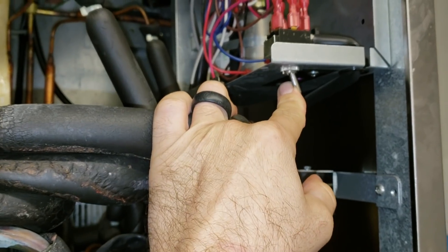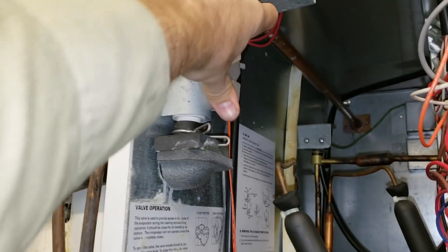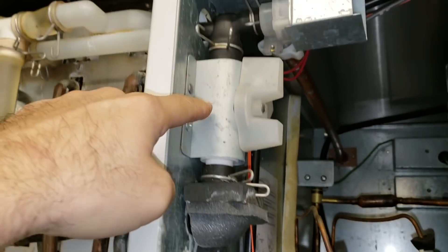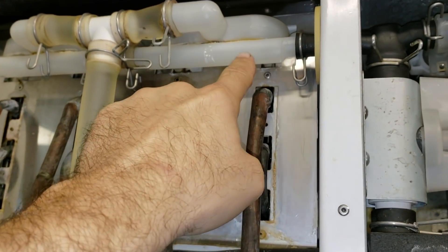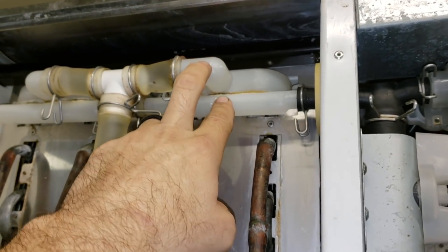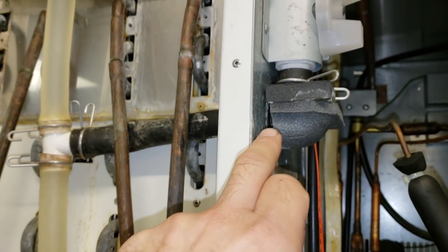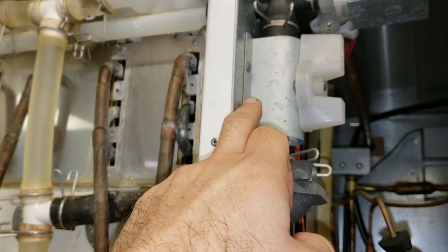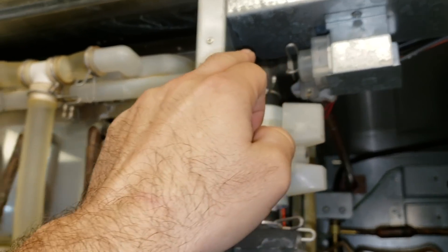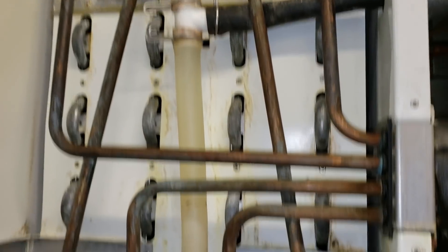I'm going to go ahead and put it into the clean mode and turn the cleaning valve. What that does is force water from the water pump up into the water distribution hose. You have a fresh water distribution line right here and a recirculation line from the pump. When I turn that — see the T going here — it forces the water. Normally the water sits there and stops; it's simply there for cleaning, but it'll help in the defrosting process. So now we're bringing water in on the water inlet rails too, which will help defrost this faster.